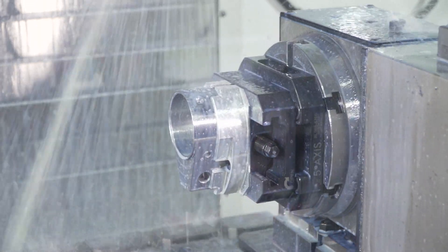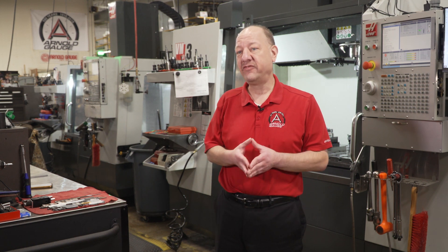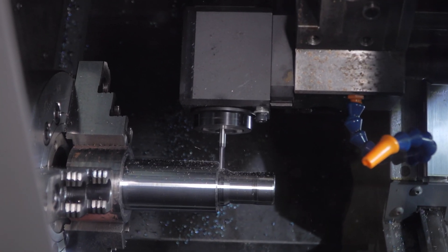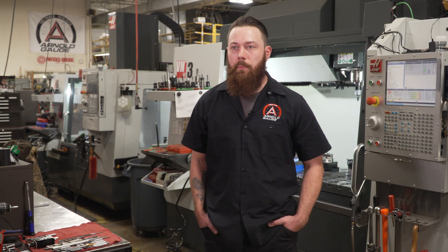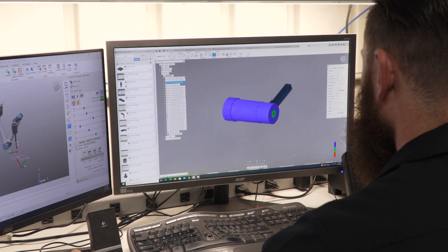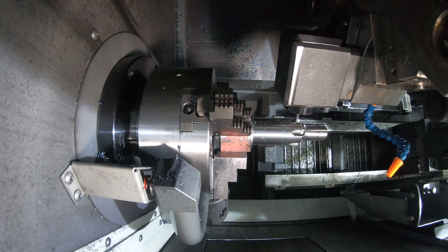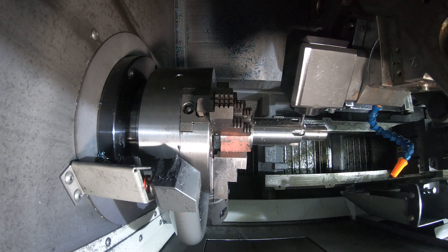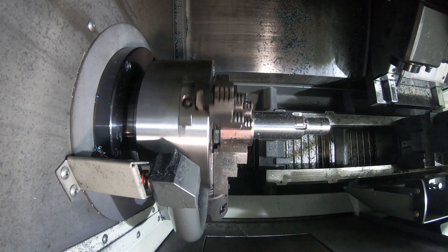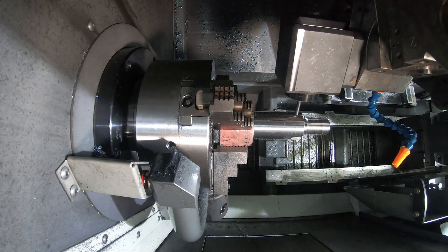As we were vertically integrating more of our parts, we saw the need to integrate turning. So the ST-15 was a great fit for us. The part we were making on the ST-15Y is a pilot — it goes on one of the gauges, a part slides over it and has fingers that come out of it and measure some ID. Running that part on the lathe with the Y axis drops our operations down from six operations to two. Having that Y axis allows us to do all the outside profile milling, putting all those pockets in there and rotating it — all from the C axis, Y axis, and X axis of the lathe.